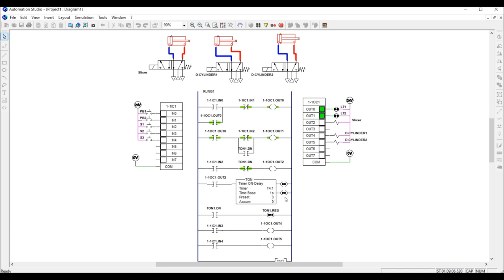After three seconds, the timer's DN output energizes a normally open contact which turns on the conveyor belt and turns off the slicer. I'll now play the simulation — clicking the sensor button simulates the pizza being detected. You can see that when I push this button, the slicer light turns on and the conveyor light turns off, and after three seconds the conveyor light turns on and the slicer light turns off.